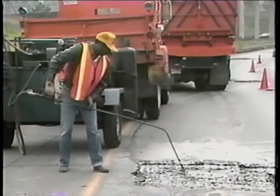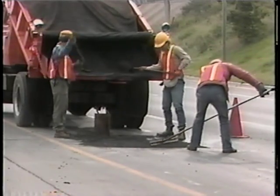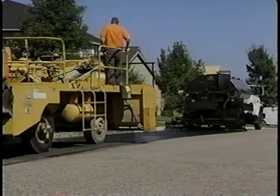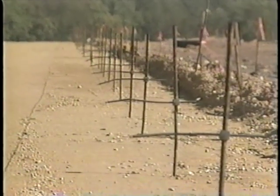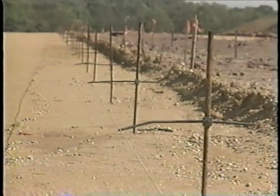Let's assume an engineer has gathered the necessary data and is beginning to plan specific maintenance projects. For newer pavements, and when no traffic increase is expected, engineers are likely to recommend preventive maintenance techniques — patching potholes, filling cracks, or applying a seal coat. When an asphalt pavement gets old, after 20 or 40 years of service, the engineer often decides to remove and reconstruct the entire pavement from the bottom up. It's between a pavement's youth and its old age that engineers commonly decide on an overlay.